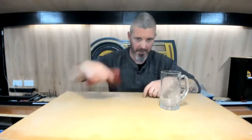So have water at the start. If you get a glob, get your cloth, dip it in and clean as you go. You don't go back a couple of hours later with sandpaper, because caulk doesn't sand like a wall or like filler, because of those oil characteristics. So I wouldn't sand caulk; I'd only sand filler. With caulk, you get it right as you're putting it on, and then you let it go, and the next time you'll see it is when you're painting it.